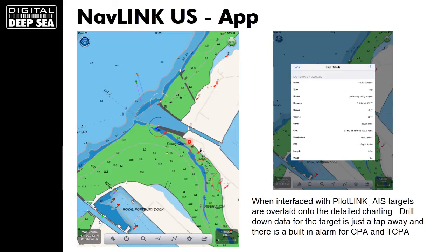These screenshots show how data can be displayed. The AIS targets are located on the chart and colour-coded according to the type of vessel. They also feature a heading line so you can quickly establish visually which direction the targets are heading. If you click on a target, you'll bring up static data including the name, vessel type, status, bearing and distance, course and speed, MMSI number and call sign, closest point of approach, time to closest point of approach, destination, and estimated time of arrival.